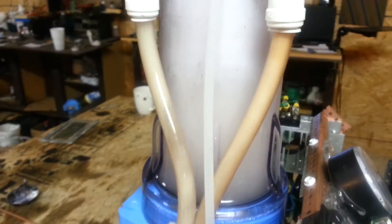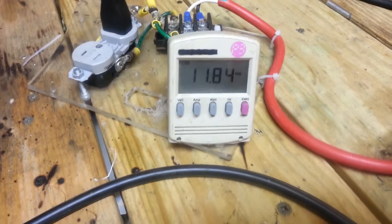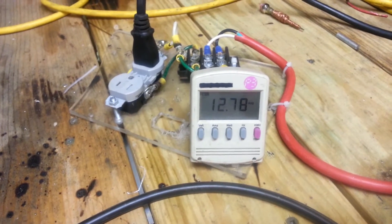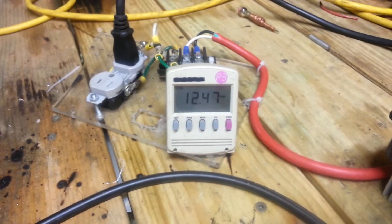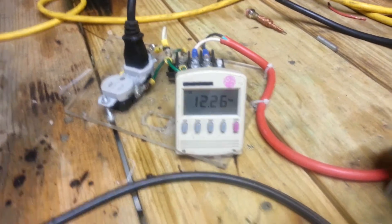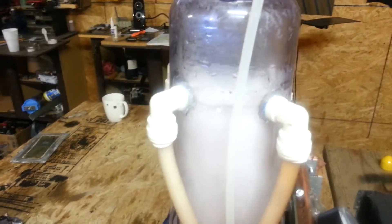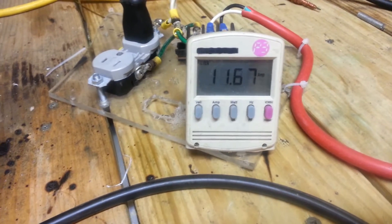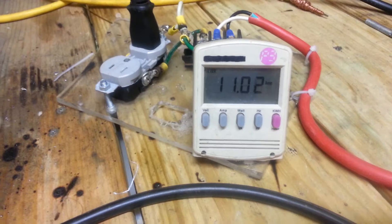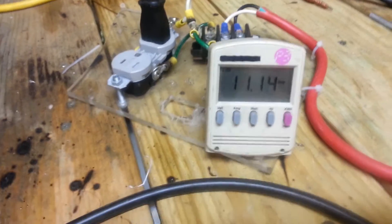I just wanted to show you the excessive flow port circulation system to give you an idea. Watch the amperage when I kick this pump on — that's at 11 amps without the pump. I've just switched on the pump and you can see it kicks it up quite a bit; it usually jumps all the way up to 15 amps when I do that. You can see it because I don't have a bubble filter I get excessive foaming. Sorry for the bad camera shot — this is a phone. I'm going to shut that pump back off. It doesn't give a significant increase in current but it is quite a bit — I did not adjust the power to the system at all, all I did was increase the electrolyte flow.